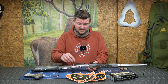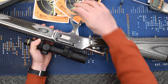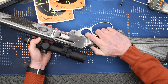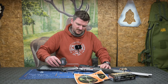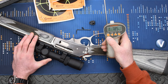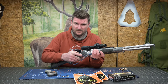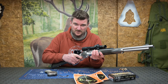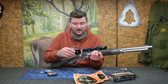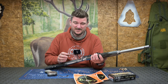The action itself is 416 stainless but the bolt within is steel and it's nickel plated. It's also fluted to give you a really smooth reciprocating stroke and make sure there's no galling or corrosion between the two metal surfaces. Pull weight on the single stage trigger comes in at 1785 grams which is 3 lb 15 oz. The trigger is consistent with no creep at all and the heavier pull weight ideally suits colder climates where you might be wearing gloves.